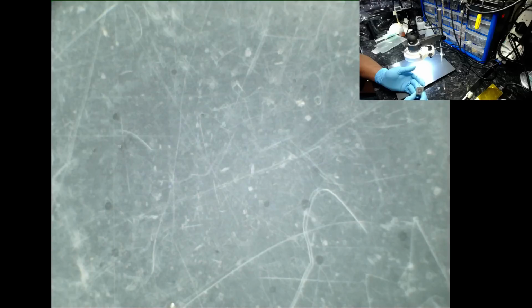So I always try and use one of them, but if you don't have one, then you don't necessarily need to. But in terms of buying stencils, I'd probably recommend direct heat stencils over these, because if you're using too much flux, God help you, you will have a lot of problems reballing the chip and things like that.